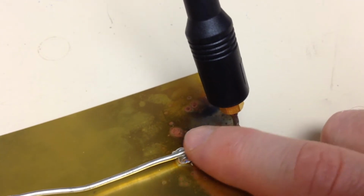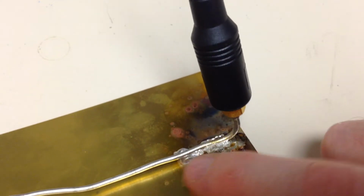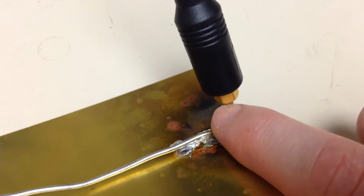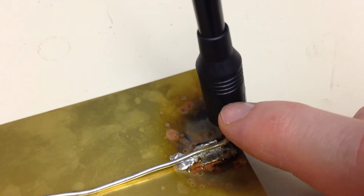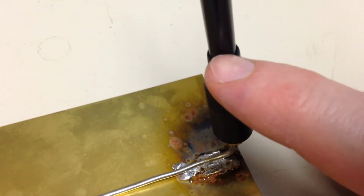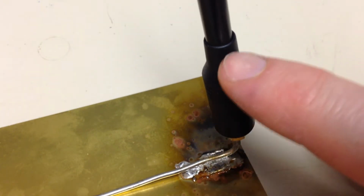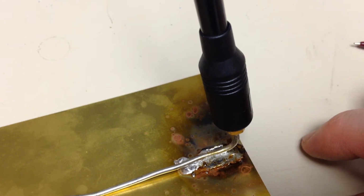As we move down onto this ground plane right here, you're not going to get much radiation off here. It's going to act as a true ground plane. With this short section of cable, we're going to get radiation here. We get radiation off the lower section of the inside. But as we go higher in frequency past 3 gigahertz, that choke's going to kick in, and we can run our finger all along this thing and change the length. And you're not going to see much response above 3 gigahertz, again, because this thing is made to operate VHF and UHF.